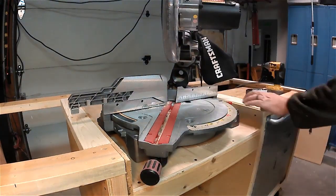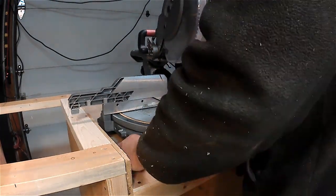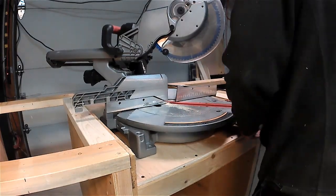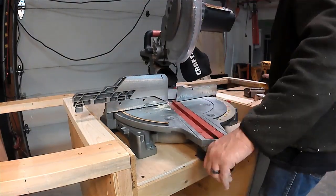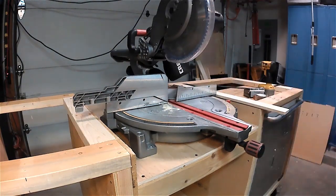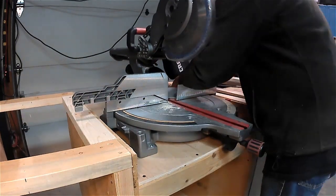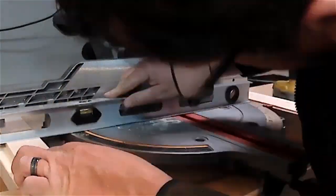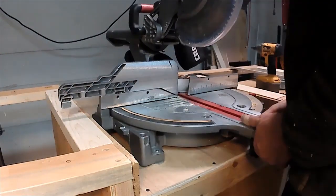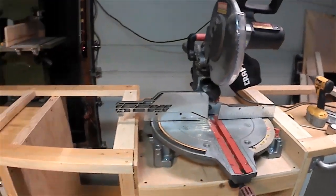I'm making sure I can swing the saw all the way around on both sides and have clearance. We're going to get it nice and straight and level. Now if you notice, this saw — like a lot of other saws — has a very deep back to it, which is going to become an issue later when I put the top cabinets on. But we want to make sure we have clearance for the miter to slide both directions. I'm taking a little piece of plywood to hold my level on and see how far off the saw is from where the finished top depth is going to be. It's just a little bit off, so I'm unscrewing the screws that attach the saw to the top and using a flat washer to shim it up just enough so it's sitting right where I need it to be. Now that we've got it attached, it sits nicely centered with plenty of room to swing back and forth.